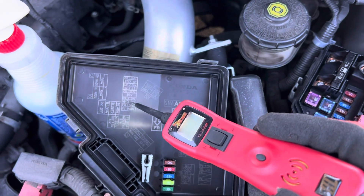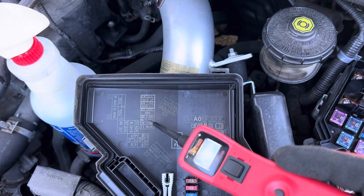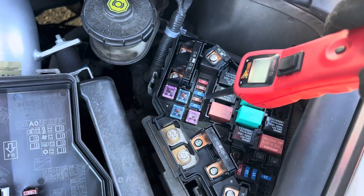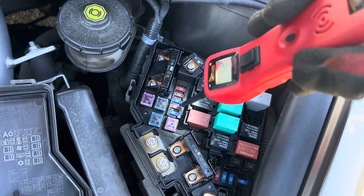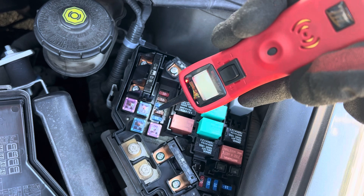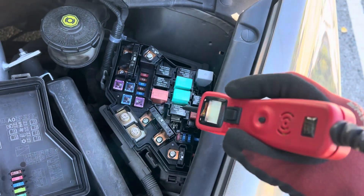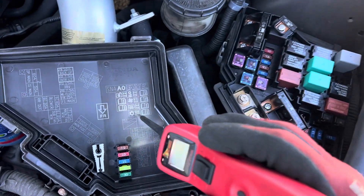According to this, the magnetic clutch — MG clutch — it says right there 7.5. So let's go right here and we got power: 14.2 on one side, 14.2 on the other side. We are good to go.